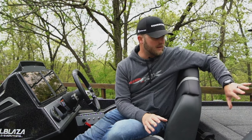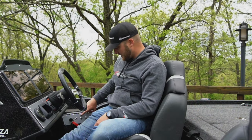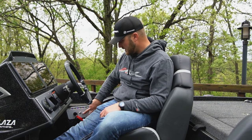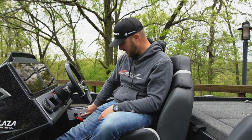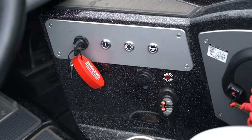One feature that I have fallen in love with on this boat: normally in most bass boats you have a breaker in the back — you want to be able to kill power at night, have a main power switch that kills everything. It's important for charging; you don't want any minor draws on your batteries. The neat thing about the Triton is there are switches right here where you can turn the main power of the boat off and on — sitting right here at the boat. You don't have to climb in and go to the back compartment. You simply hear a good click and you've got power. At the end of the day, hit the other one, you hear a good audible click, kills the power to the whole boat.